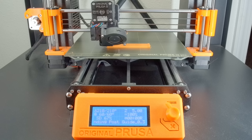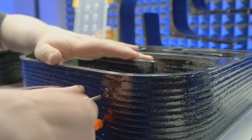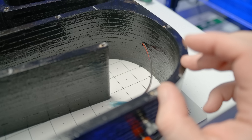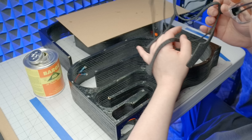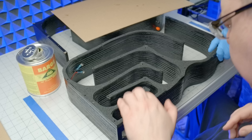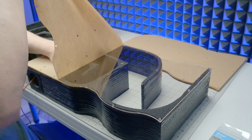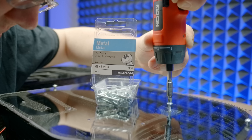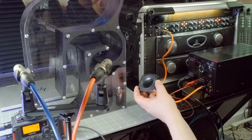Next, I'll want some binding posts around the back, and here's a little guide I made for the pilot holes. Once they're in, the cable is threaded through to the compression chamber, at which point it's onto the gaskets. I could've cut the foam into more manageable pieces, but this seemed like more fun — though not as much fun as peeling all the masking paper from the acrylic sheets or attaching them with a total of 104 metal screws.